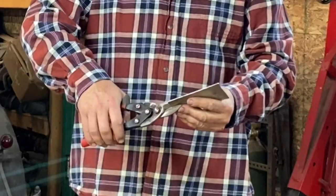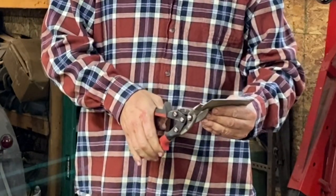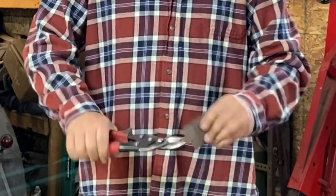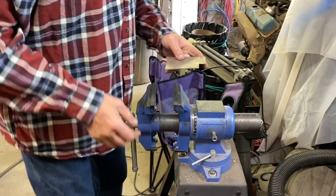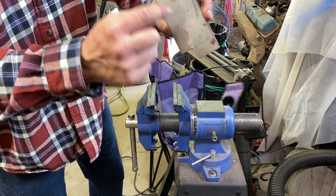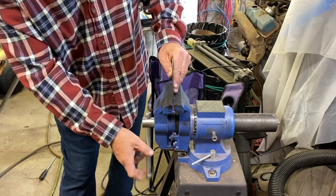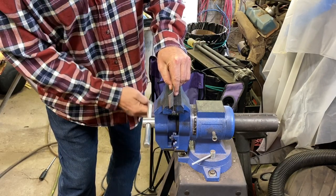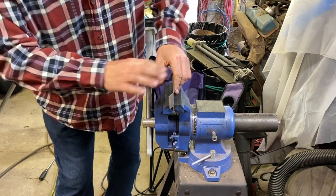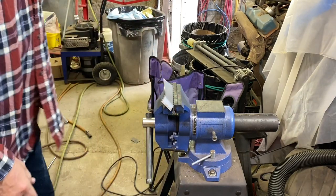We'll go through the process quickly, just showing you how to do a couple of these bends so you get the idea. I'm not taking the time to go through all the measuring — I've just got a little piece of scrap. I want to show you the principle. I'm going to ballpark about three-quarters of an inch for a corner. Try to make it fairly square. So in a box you'll have four corners that look just like this. Then we're simply going to put this in the vise. I drew lines on here where I want my bends to be. This is 18-gauge steel — it's a little heavy but you get the idea.